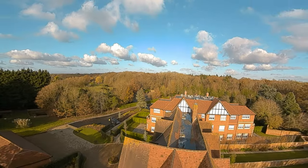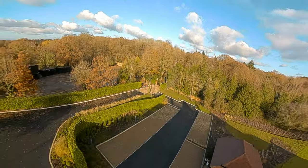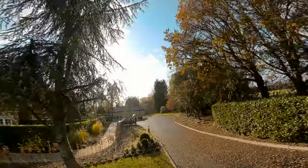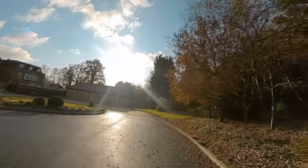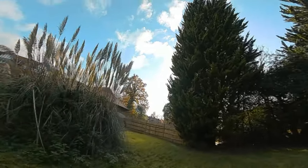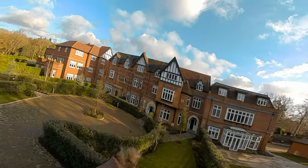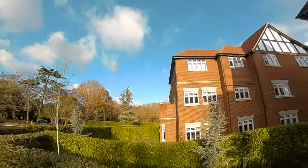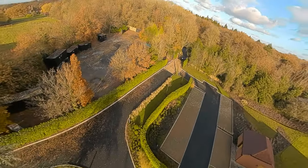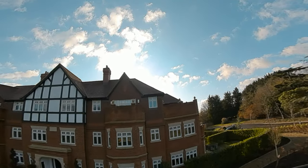With the great digital HD video range combined with the RC range of Crossfire, you can sit back and pretty much fly where you want without worrying about losing RX or VTX signal. And now with the latest DJI firmware update they've fully integrated the Betaflight OSD, so you're not missing out on any important telemetry info. You could even strap a GPS on the DC3 — it's got enough spare UARTs — and you can see your position and direction in the OSD, and enable rescue or return-to-home mode if you really wanted to.